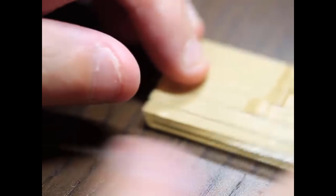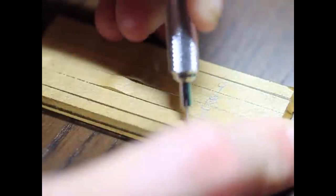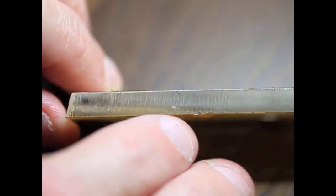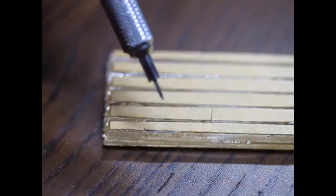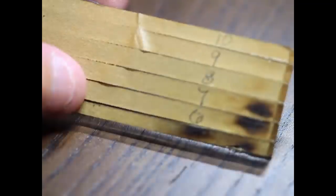This one is the test with the paper backing. Before taking the paper backing off, let's look at the cross-section: 10 is on top, then 9, 8, 7, and 6 on the bottom. Looking at the cross-section, I do see something at the location where I wasn't able to go through, and you can see there's a line from here to here inside — it wasn't able to go all the way through but reached a certain depth. This is where the nozzle was far away from the surface, so it's only getting unfocused energy. This tells me 10mm/s is more than sufficient to cut through this material, and I might even be able to go faster.